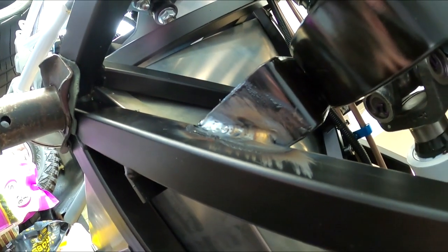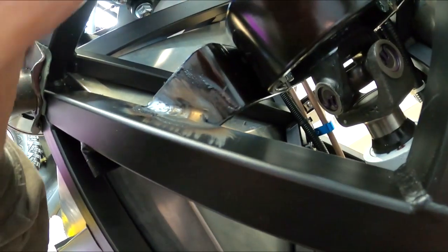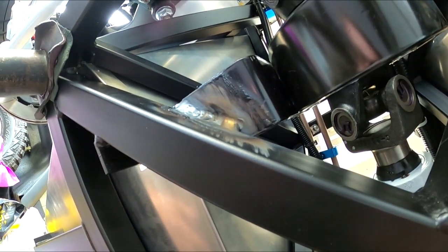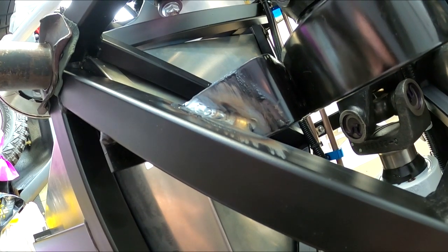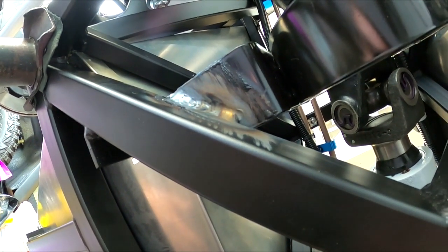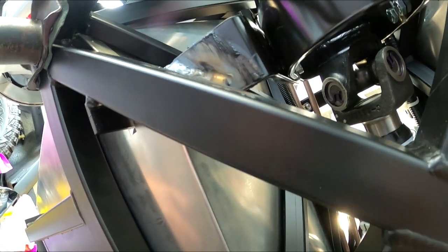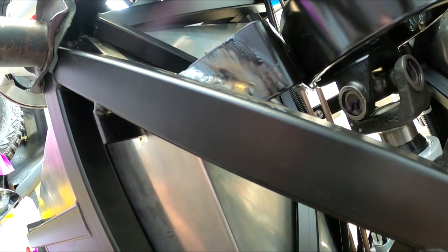The unit is welded in. I'm going to put a couple small welds up top, but I've got both sides done and I'm confident this thing's not going anywhere. No bolts coming through the bottom, no nutserts — it's just welded in, part of the chassis, and might even strengthen it. Thanks for watching another episode of the driveshaft safety loop install. Hit subscribe if you want to see more — there's definitely more coming. Thanks again and have a good one.